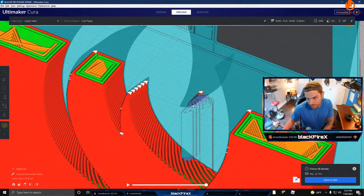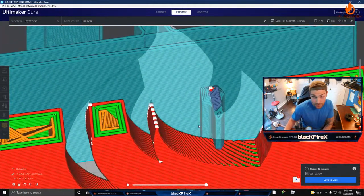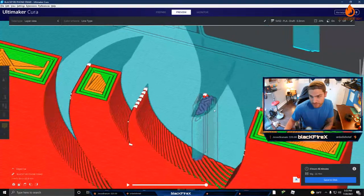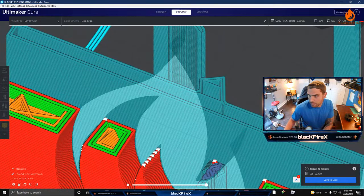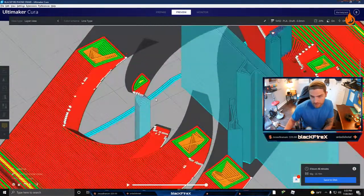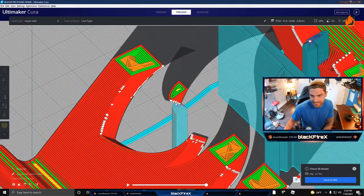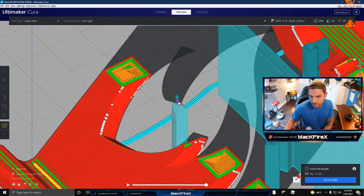If this tower breaks, I have to stop the print. And then we have to do something to the support settings, give this tower a bit more meat, a bit more durability or strength, and then we'll be able to go again. Oh, this was the one we had been looking at. Yeah, this guy comes out of the middle of nowhere, and it starts on a pinhead.